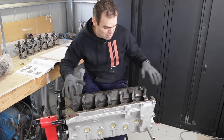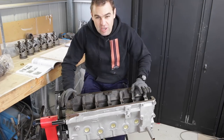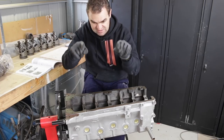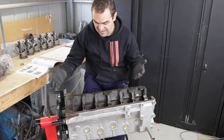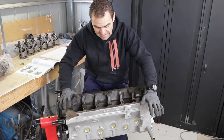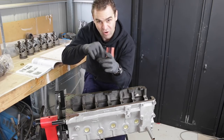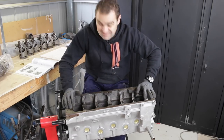The very first thing I need to do is make sure all of the bolt holes are clean and have good threads, and that means going through and running a tap through all of them. I only actually own a couple of bottoming taps — those are the ones you need to use. Instead of tapering at the bottom like a regular cutting tap, a bottoming tap has threads all the way down and is square at the base, so it can cut a thread all the way to the bottom. It's quite important, particularly when you want to torque things to a correct spec, that you've got a nice clean thread, so you're not getting a false torque reading from contamination in the hole. Let's start tapping some holes.